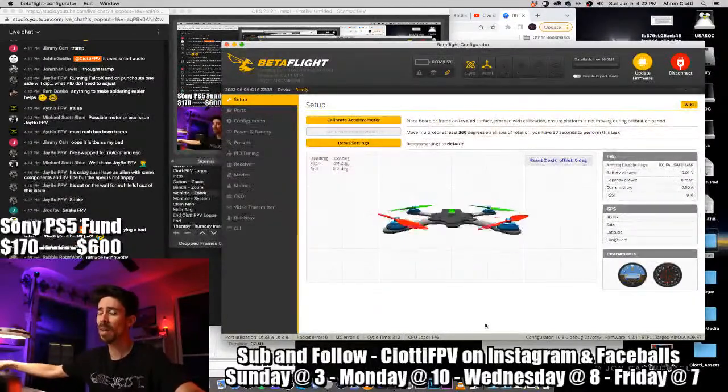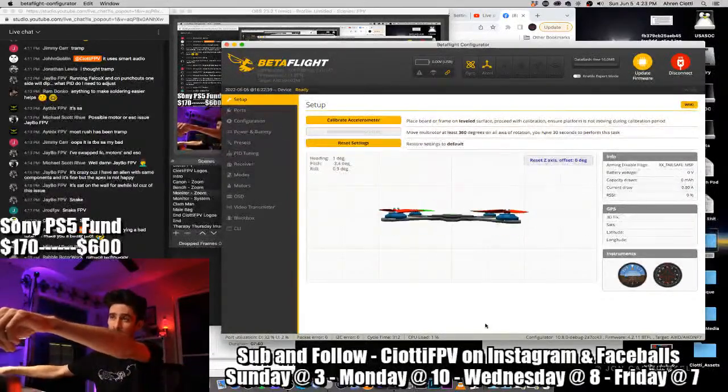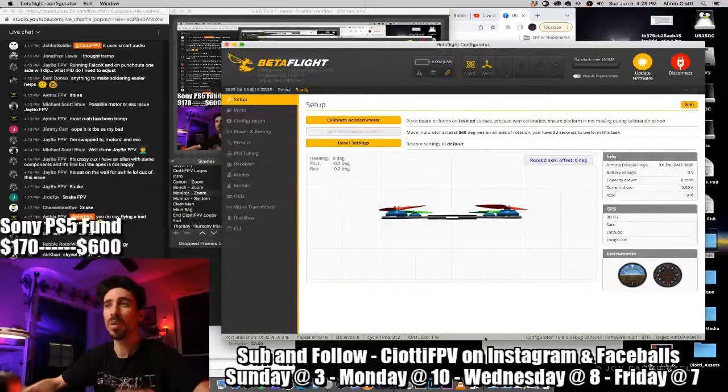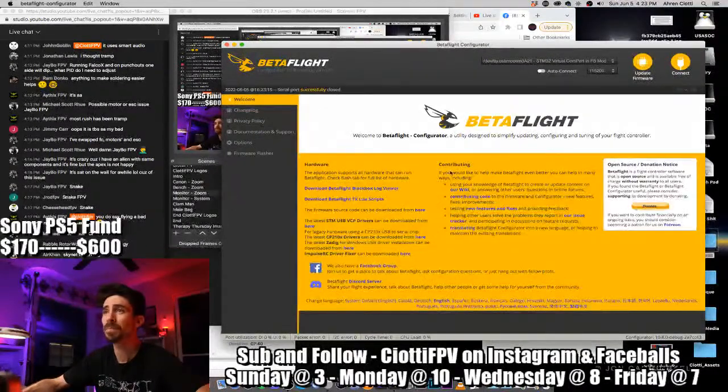That ain't right. This is the left side of the physical quad lifting up, and in Betaflight, it's the nose of the quad lifting up. So we need to rotate in the configuration, the gyro alignment. So let's go into here, and I think we just need to yaw it. We either need to yaw it 90 or 270. So we're gonna try 90, save and reboot,